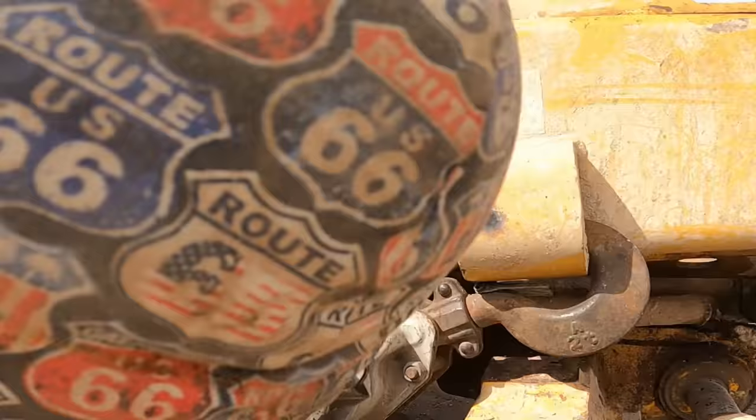And what I would do is I'm going to use my wire machine for this. I'm going to run it a little bit hot on the voltage side and back it off on the wire. That way it has a nice arc, instant arc. But I will have to be careful that I don't blow through. It's kind of a funny balance. So I think that's about as clean as I'm gonna get it.